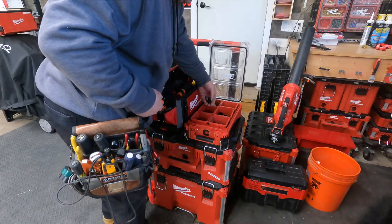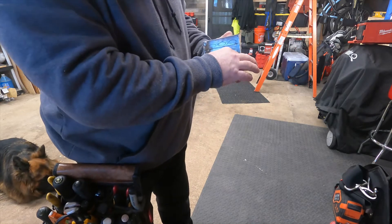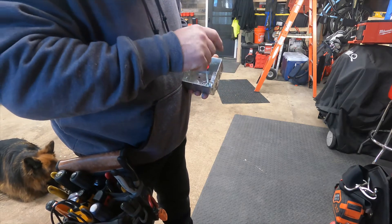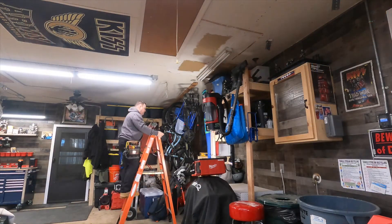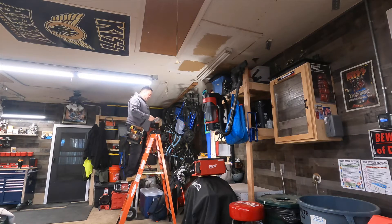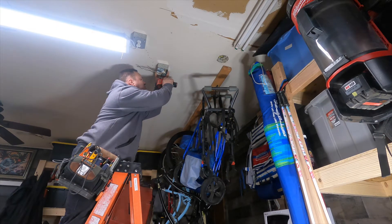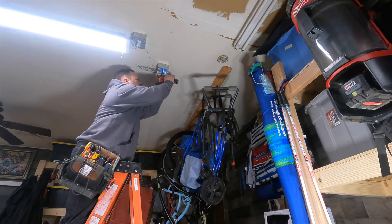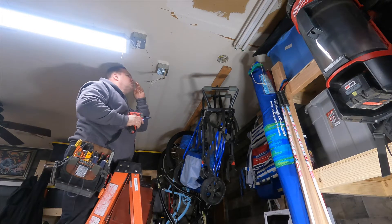This will make up what's referred to as a surface mounted junction box. By installing this grounding screw into the box, what we're essentially doing is terminating one of the equipment grounding conductors to the box, therefore grounding the metal box. After the box is prepared with the grounding screw, I'm gonna knock out one of the knockouts at the bottom of the box and attach it to the ceiling using two-inch screws. I actually like to use galvanized exterior screws — I keep the two-inch variety on hand and they go through sheetrock very simply, probably a little overkill but that's okay.